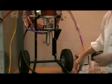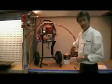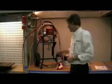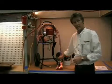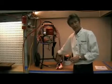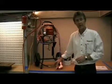If you get material through there, it tells you it's a plugged tip and you need to clean the tip. But if you still get no material through the pump even though it's building pressure, you're going to want to check and loosen the hose assembly to see if you get any material through it. When you loosen the hose assembly, cover it with a rag and loosen it very slowly so that any pressure in there is released.